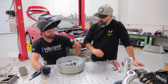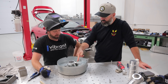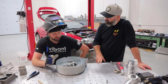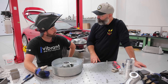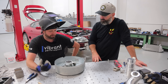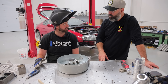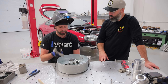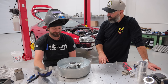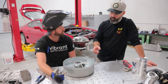One of the last challenges we have is welding this HD ferrule to the throttle body. You raised the very relevant point that there are rubber seals on the side of the butterfly valve and you don't want to melt those while welding this on. Taking the throttle shaft — the throttle plate shaft out is not an option because we won't ever get it back the same way, so we jerry-rigged something. Water's a great thermal barrier and it'll draw a ton of heat out of the part. I've got a little metal base in here that I'm still grounded to the table, and the metal will transmit the current through the bottom of the part, which is still touching the basin. Hopefully the water won't allow that heat to permeate through the part and get to where the washers or the gaskets are.